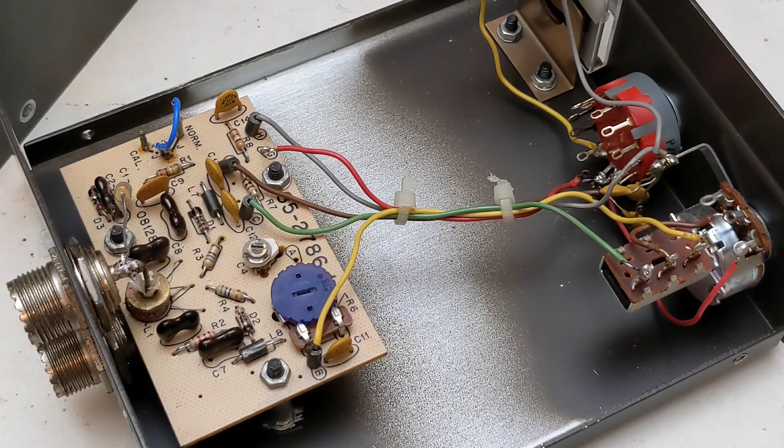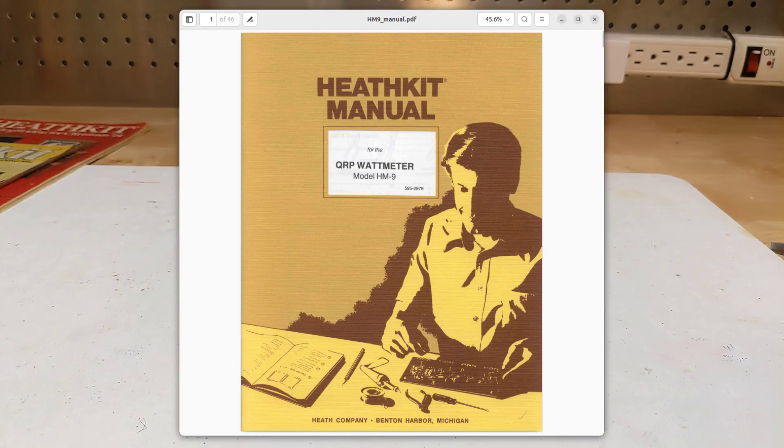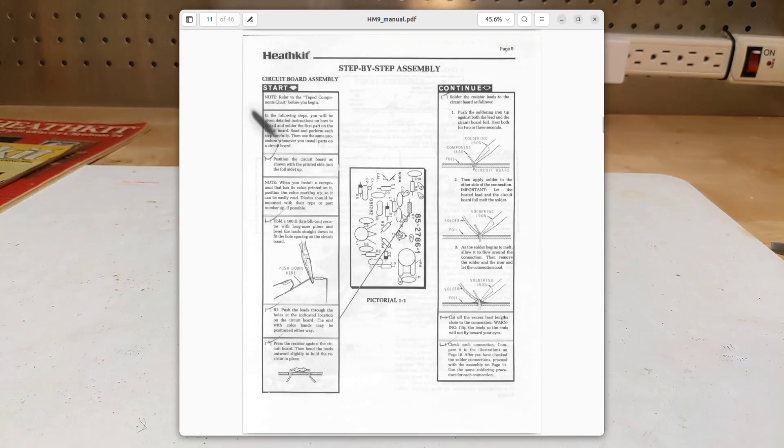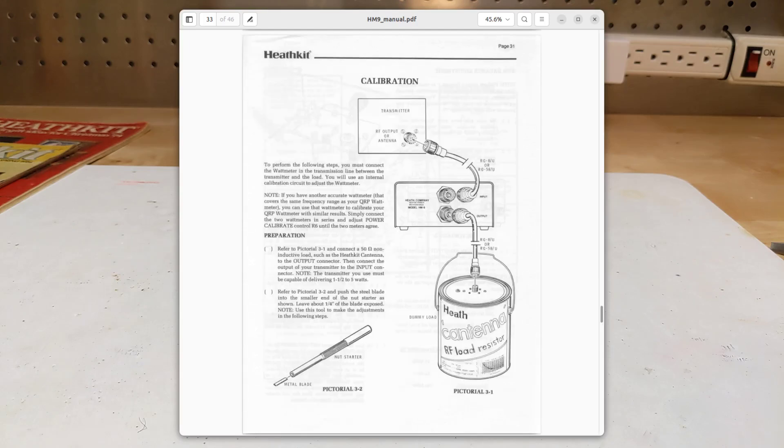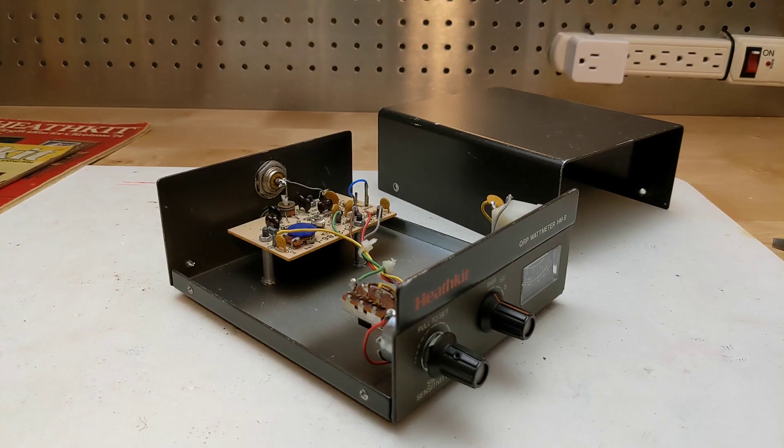The values of R1 and R8 were changed slightly in later revisions of the unit. I bought this unit on eBay in July of 2025 from a local seller. It was complete but didn't come with a manual, though I was able to find a full manual and schematics online. It's the usual detailed manual that Heathkit was renowned for — almost 50 pages with detailed assembly instructions, operation, and circuit description. The unit was in good shape with some scratches on the case, construction quality was good, and no obvious modifications had been done. Checking the component values, it had been wired for the 144 to 148 MHz 2 meter band option.